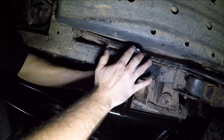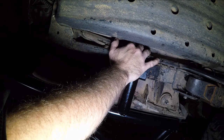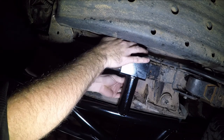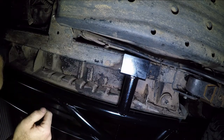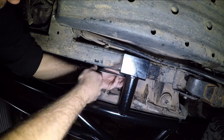Here's a good trick: hold the nut in two fingers on the end of the bolt, and just twist the bolt. You'll feel that pull the nut towards the surface of the washer. Then we're going to have to do it up from the outside pretty much.